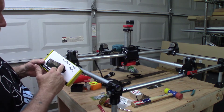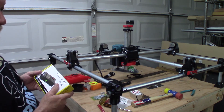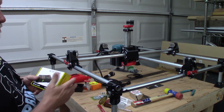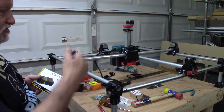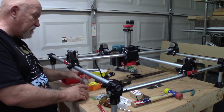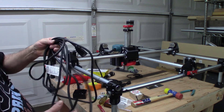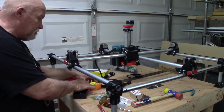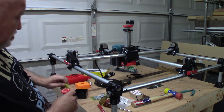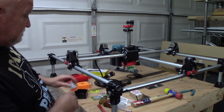What's nice about the IOT relay is that I have an on/off switch and a breaker, but I can also control it from the control board. If I need to hit emergency stop or shut anything off, I can kill the power to the Makita right away — if a belt breaks, something goes crazy, or the wood starts to catch fire. I also bought a long black power cord from Lowe's and I'm going to run it to an emergency stop button right here at the front of the machine.